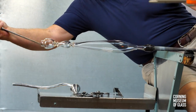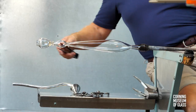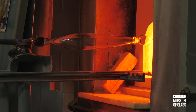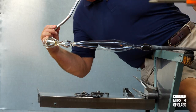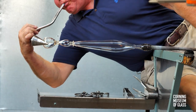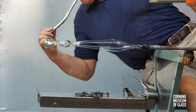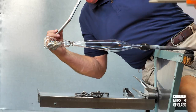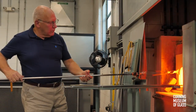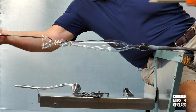After reheating, the hole is dilated. The entire foot bubble is slightly softened. The soffietta is used to inflate the bubble further, and the lower-most part of the stem is blown to cool it. During reheating, the stem unavoidably softens slightly. The flute has a folded edge at its foot — it's a double thickness of glass that's both attractive and strong.